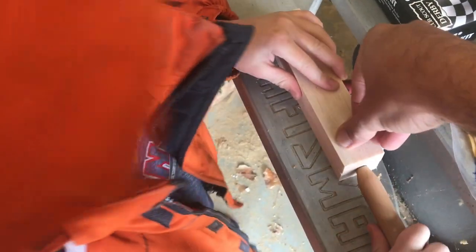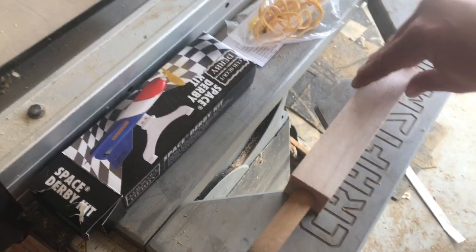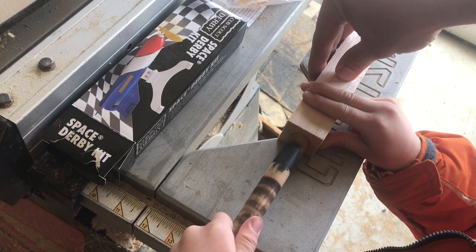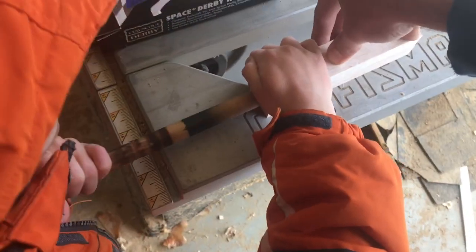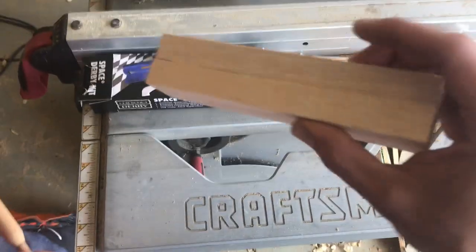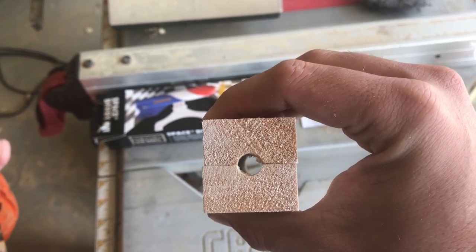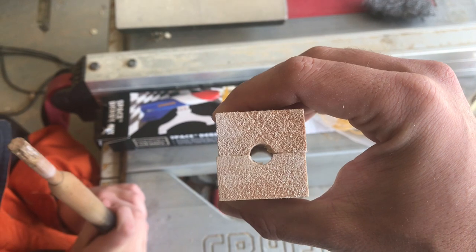Pull it out — twist and pull. Now try the other end, make sure that other end is aligned. Does it fit tight? Does it feel round? Pull it out. We don't want the glue to stick to it. Now we've got to let this set up and dry. If you look at the outside, you'll see that our blocks don't exactly line up — our edge is a little off — but our hole in the middle is dead center. When we glue them up, we want to line it around the hole in the middle, because the outside is all going to get sanded away.